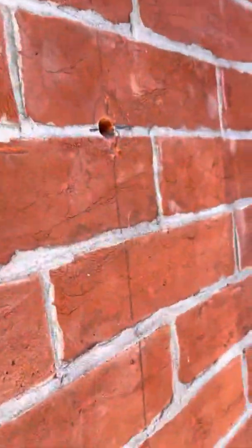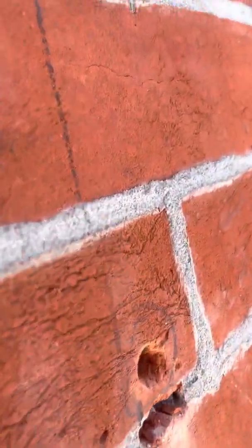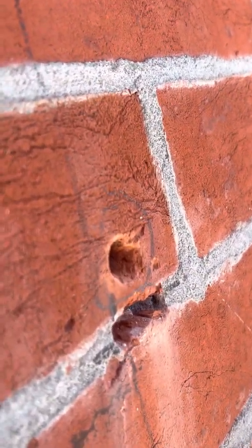That's twisted in, and now on the outside all you have to do is patch the holes. Just get a little brick dye and match the holes, or a little mortar dye. Most of them go through the mortar but the hole gets into the brick a little bit. You get a little mortar dye, a little red dye, patch it up — you'll never see it — and then just repoint the mortar. That's it — those are your helical ties.